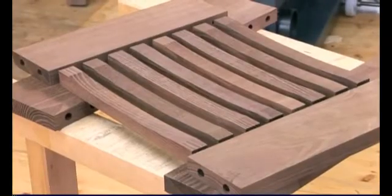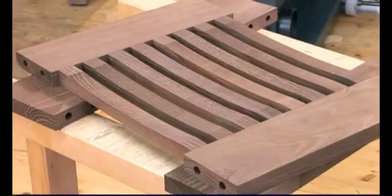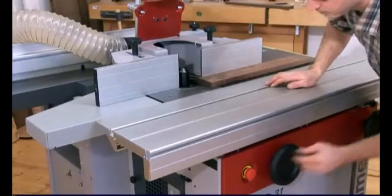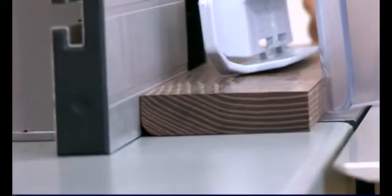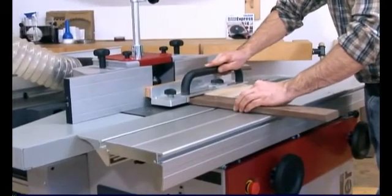Next, the individual components of the seat have to be glued together. Now we will see whether all of the cuts and holes have been carried out accurately — everything fits together perfectly. Helmut is now going to use the spindle to round off the tops of the armrests. The height adjustment of the spindle moulder is carried out by adjusting the hand wheel at the front of the machine. Whilst using the spindle, the spindle fence guard keeps the operator safe and at the same time keeps pressure against the workpiece, pushing it against the fence. In order to use the spindle for the ends of the armrests, the workpiece holder for the profile pieces is a perfect accessory for the job.